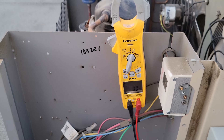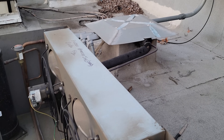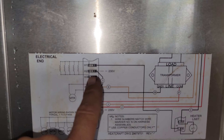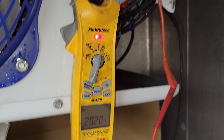We've got to figure out why our evaporator doesn't have power. We have three phases up here. We need to find the power going down to the evaporator — is it up here or is it powered separately? I come down here — that's just the control board. Over to this side, we look at the schematic. It says line voltage should be hooked up to H2 and J.